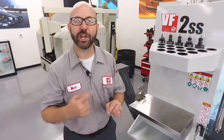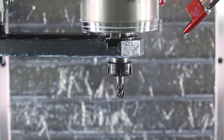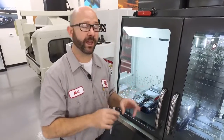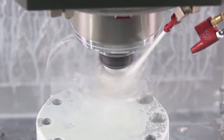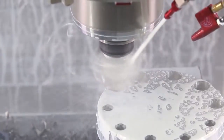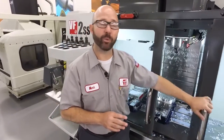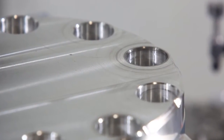We've got a tool that's got chips wrapped around it — how big of a deal can that be? Well, it can be awful. If we do a tool change with chips wrapped around the tool in the spindle, those chips could get caught up in the tool change arm and cause a fault. Worse than that, if those chips catch a hold of the probe in the tool carousel, we could have problems there too. Also, if we have a big ball of chips wrapped around our tool, those act like a force field, keeping all the coolant away from our cutting edge. Our tool's gonna wear out prematurely — or worse, it could break because it's running dry. On top of this, we've all had parts that ended up with great big swirl marks across the face as those chips dragged across the surface.